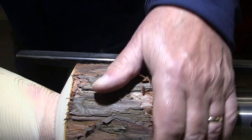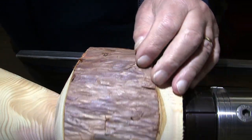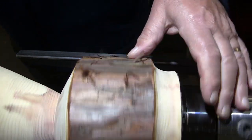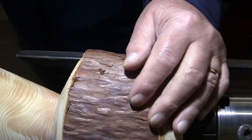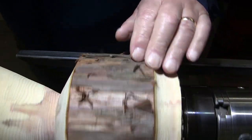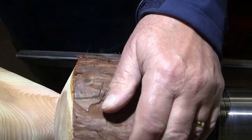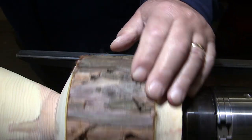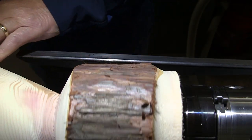Well, I took this in the house and microwaved it, very low power, power level 3 for 1 minute at a time. I left about 10-15 minutes in between and I did it, I don't even know, 4 or 5 times, not that much. Just to kind of dry the surface out, which worked. I'm sure the piece is not anywhere near dry, but the surface is, and that'll make it easier to sand.